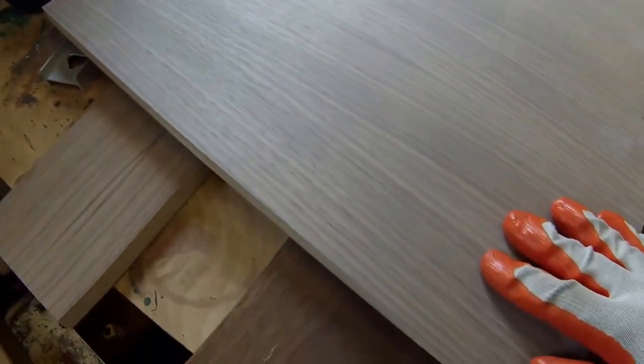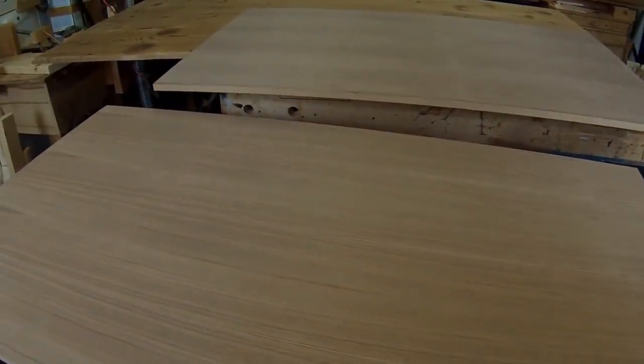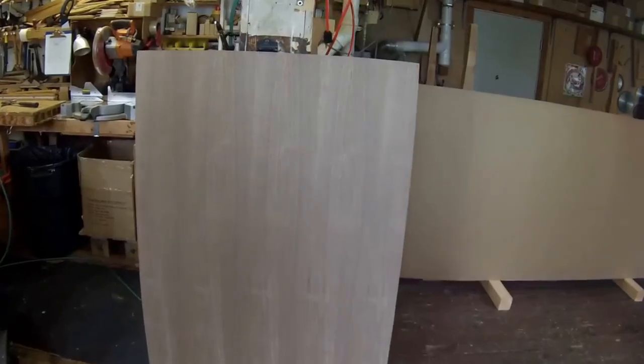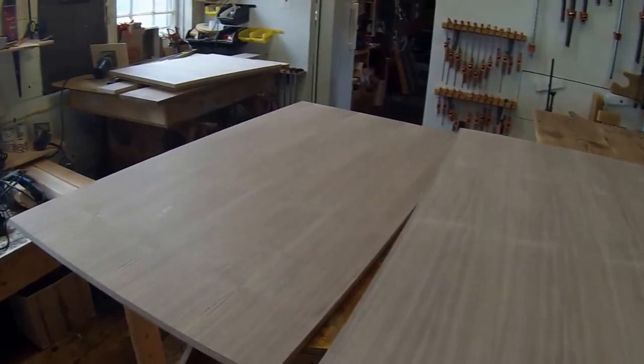That way I can tone these a little bit darker because the solid walnut has a darker tone than the veneered walnut. So I'm gonna just try to work with that and get it a little bit closer so that this won't be so light. Because the customer really liked the contrast of the dark solid walnut with the maple. And then these veneered sheets came in, and the walnut was 10 shades lighter, which sometimes happens. I think it's just a variation in where the material is sourced from. Wherever this is, the walnut just grows a little bit lighter. I don't know.